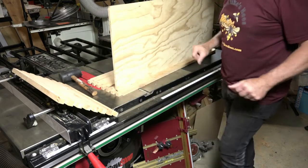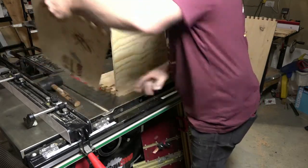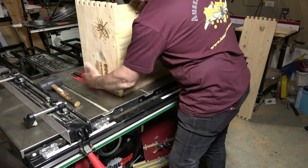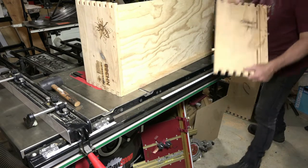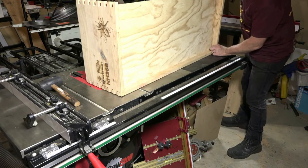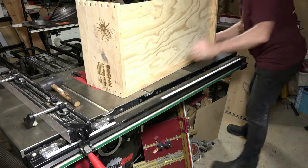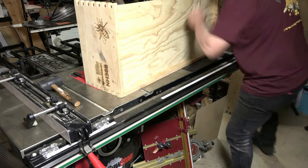It's actually a sliding fit like the bottom of drawers, so it can move around at a different rate than the solid timber that we have for the rest of the build. So that's that end. Pop on the other end now, up the far end. With any luck, it'll all just slide in. Alright, that's actually looking pretty good so far.